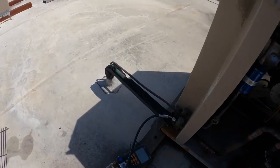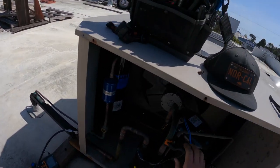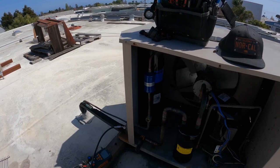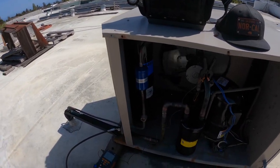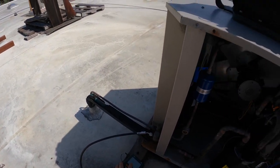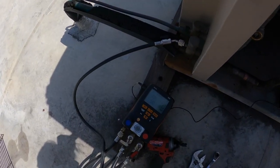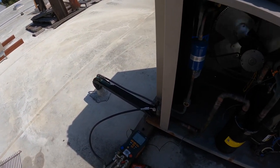Let's see. Our accumulator in. We got 22, 21 for our compressor superheat. Check it on this side. Accumulator in. TXV, man, getting that TXV adjusted was barely getting there. And look, I'm barely at 20 degrees, 21 degrees superheat at the compressor. 20s minimum, so with the accumulator and everything adjusted, I think this little guy's gonna be all right. I got enough compressor superheat now, barely. And I think,